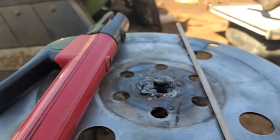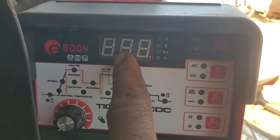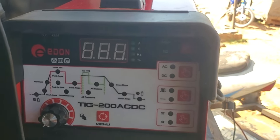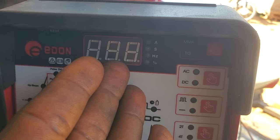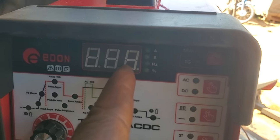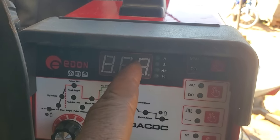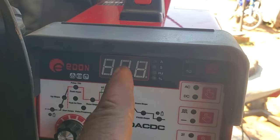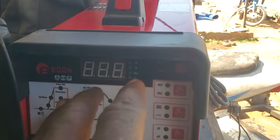The fourth tip: the best cutting-edge amperage range is between 80 and 115 amps. The lighter the material, the smaller the amperage. The thicker the material, the higher the amperage. For better penetration when dealing with thicker metal, take the amperage between 100 and 115. For lightweight thin material, you want to be between 25 and 80 depending on the gauge. You need a lot of practice to know the right amperage based on the metal gauge you're welding.